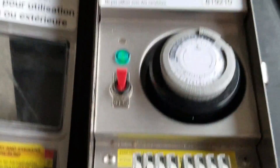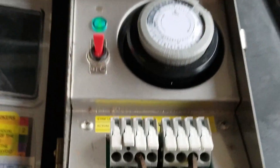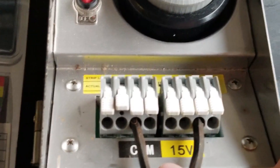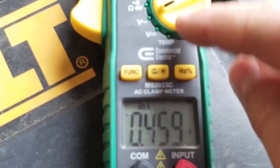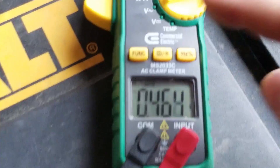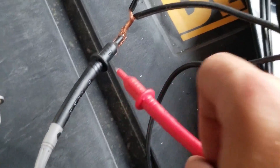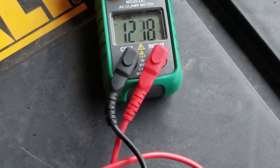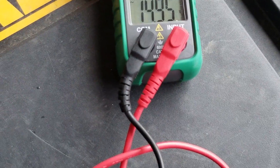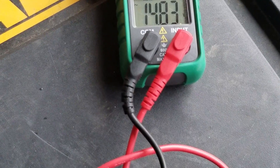So if you have a thin wire and you go 300 feet, it might drop like 5 volts. Now, there is an equation to calculate how much the voltage drops, but I don't think you really need it. Honestly, you could just check the furthest light with a voltmeter and see how many volts it is, and you can just do it that way.